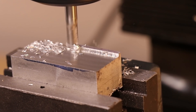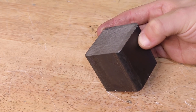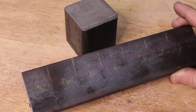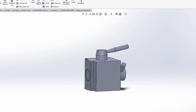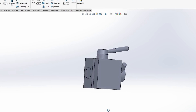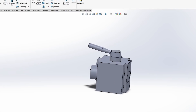I have a 50 by 50 bar of mild steel, and another piece that's 50 by 20 by 200-ish. Total cost comes to about 15 bucks of steel. I've drawn up a basic design in CAD. Most tool posts tend to use a cam locking and piston design. However, I'd like to use a more compact screw and pin locking design — it should be a lot simpler and quicker to make.